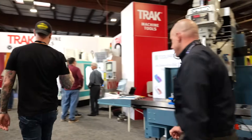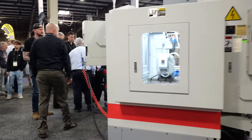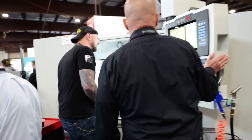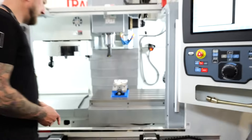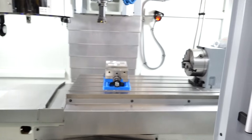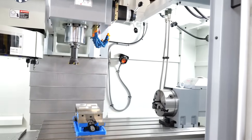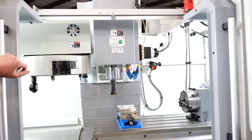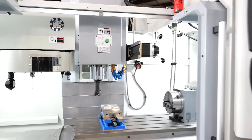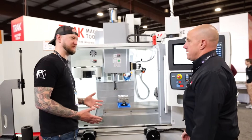This one over here is a full CNC mill — a box-style machine. It's the only CNC machining center on the market where you can run two-axis, three-axis, and four-axis additionally. You guys even make your own four-axis. Here we have electronic handwheels, and it runs just like the DPM bedmills. But in addition to that, we have a Z-axis handwheel as well — so if we're in DRO mode, we can pull this third-axis handle out and have full control over Z. Although it looks like a box-style machine, it has full tool-room capability for when you need that kind of work.